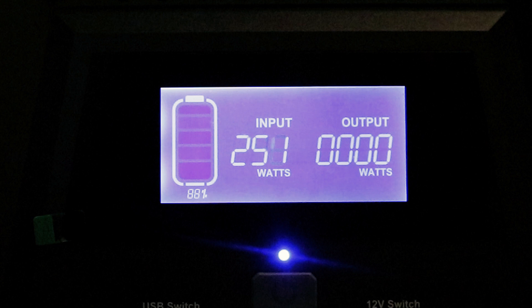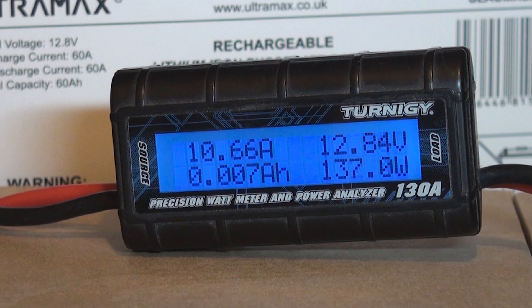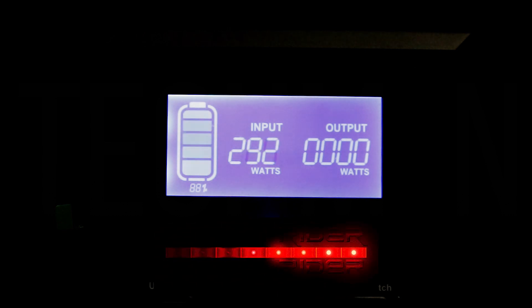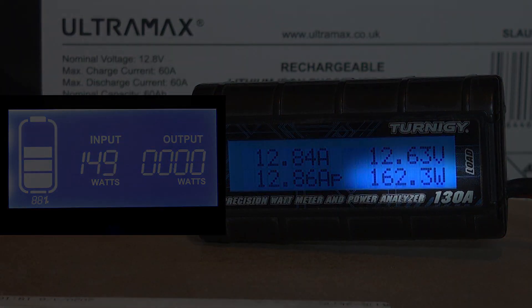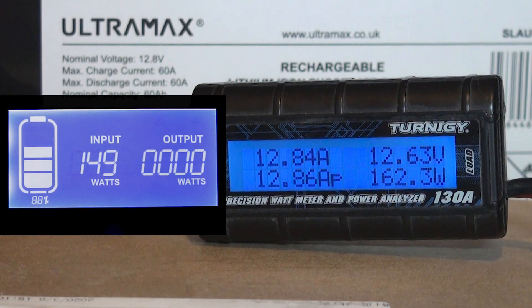This may differ if the battery state of charge is different from what it was with my batteries. Perhaps the unit takes in more amps at lower voltage — I'm not sure. Coming back to the 12V test, the battery voltage at 10A load was 12.84V during our experiment. I like how the input display revved up like a speedometer and not just in increments. There was quite a bit of energy loss when recharging at 12V — I don't know why this occurred, but we didn't see that at 24V, which is quite strange.